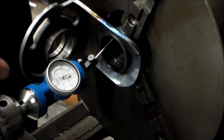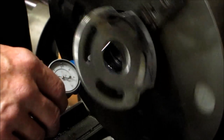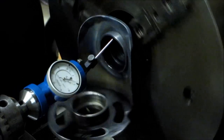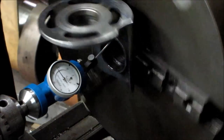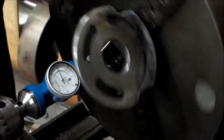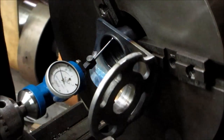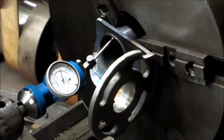I just happen to have the luxury of being able to get it in here and swing this around without hitting the dial. I'm going to go ahead and swing a zero over here — we're reading about five right there. I'm moving her in and out just trying to check to see if she's a little bit different. There's like two little eggs there depending on how close we were to the weld. It's like two zigzags almost — I'm going to call that equal. We know that the weld gives it distortion, so we just want to minimize that as close as we can.